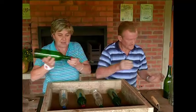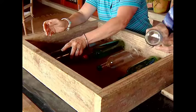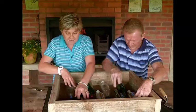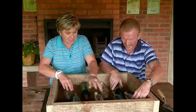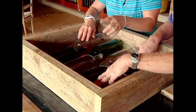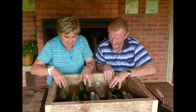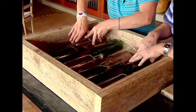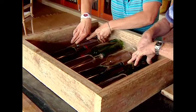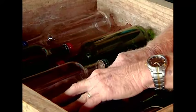Important that the lids are kept on — you're going to realise exactly why in a minute. These guys are now going facing inwards, basically in the gaps. The reason why we haven't pushed them in is so that we can just move them across to get our final spacing. Most important is that they're not touching each other, because we need the concrete we put in to fill the gaps in between and hold them in place. Now create a bit of an indent by firming each bottle down so that the neck of the bottle is just above the base surface.